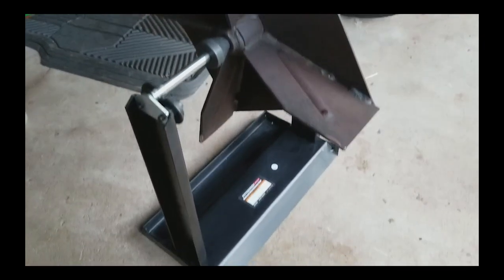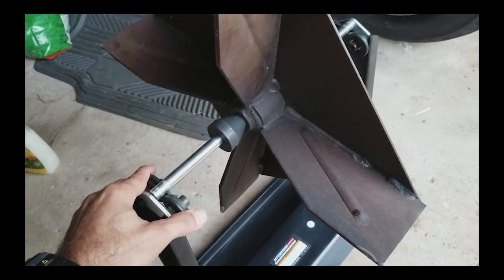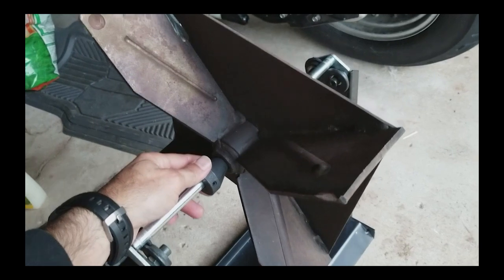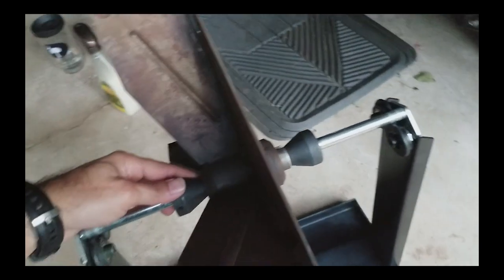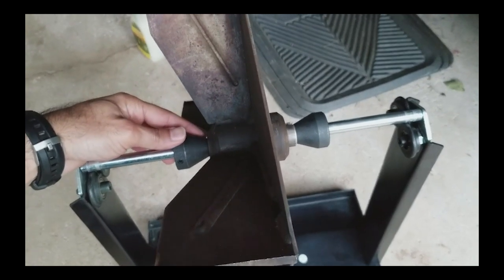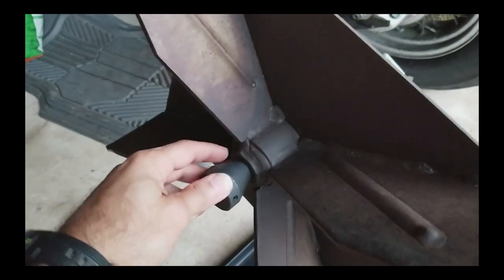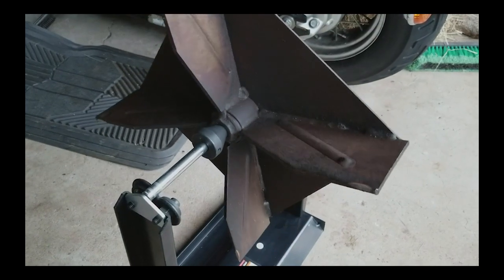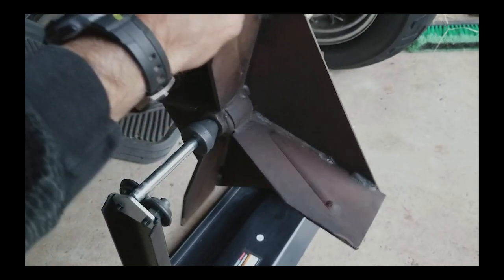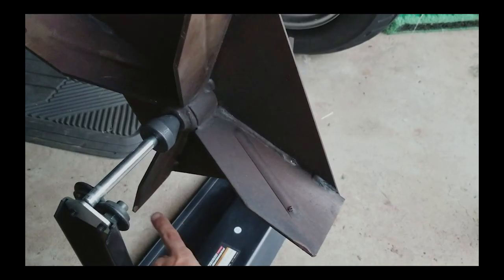This device is pretty simple — it's a stand with low rolling resistance bearings and rollers, with a shaft and a couple of conical anchors that sandwich the object to be balanced. You roll it to varying locations to make sure it doesn't self-rotate back to another position, which would indicate a heavier weight on one side. As you can see, it is out of balance because it's moving on its own to find equilibrium.